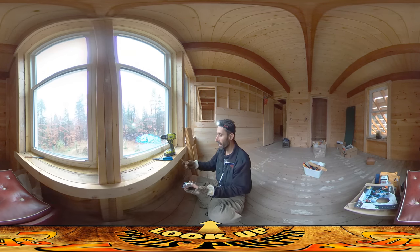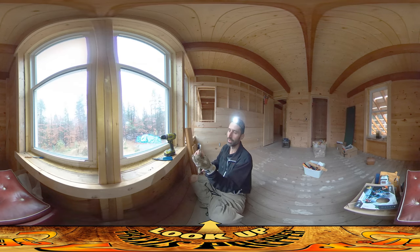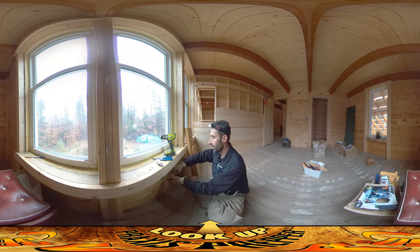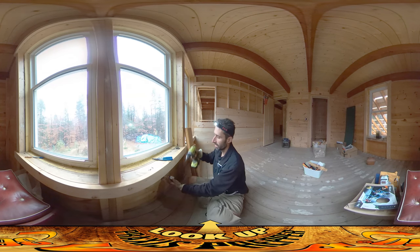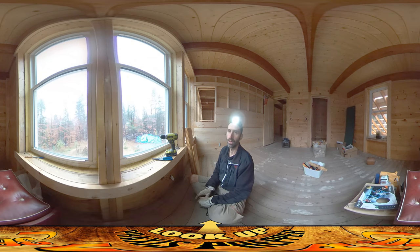As far as what I do with the wires: the whites go to the silver posts, the blacks go to the brass posts, and the grounding wire goes onto the green grounding screw. They may not always be labeled by color but they're usually labeled. I'm using little pliers to put a small bend in the wire so it hooks right around the post, then I use the drill to secure it.